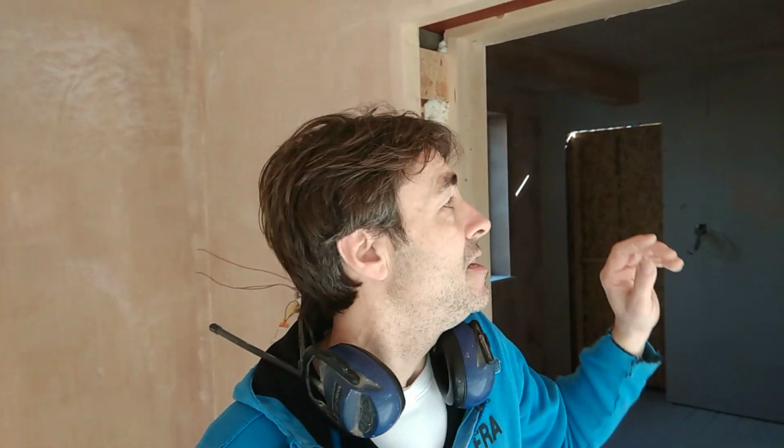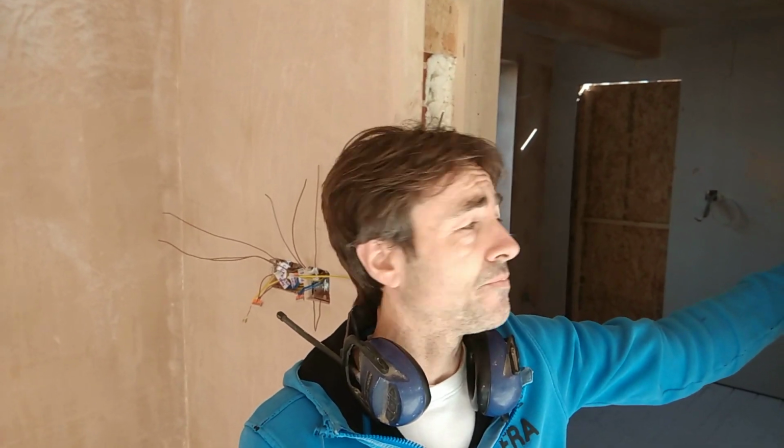And then you might think, well, what are you going to do with the doorstop? So with a skeleton lining, the way that you make it, what looks really lovely is you hang your door, and then if you're using an internal door, like a 38mm door, you run an MDF stop all the way across and set it back the thickness of the door. So when the door's open, you've got equal rebate both sides. It really looks nice, it really looks substantial. And then when you frame it with the architrave both sides, boom, that's a fantastic finish.